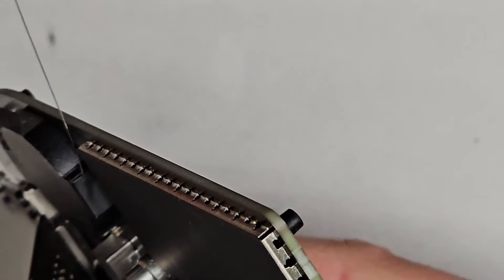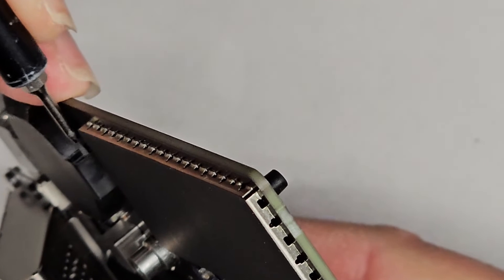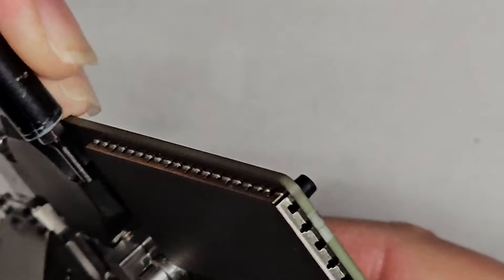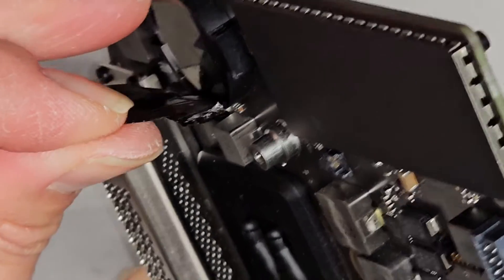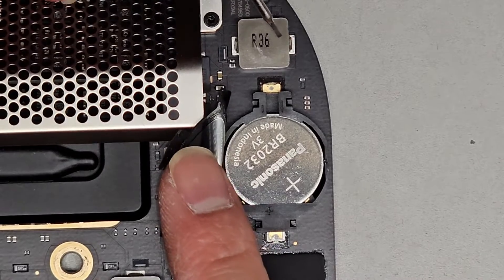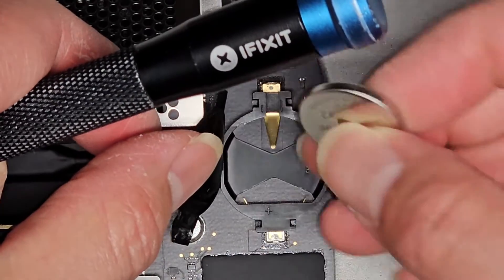Get the flathead screwdriver in there and work our way down. As we push it, it's going to slowly lift up the adhesive. We're working towards the bottom first and then going up. Now that we got that peeled up, we should be able to pull this. If it doesn't come up, you might have to pull up the tab and peel that. There we go — now we have that open. Now we have access to the battery. Push the battery inwards and then lift up. There is the battery — and actually it's not a CR2032, it's a BR2032.